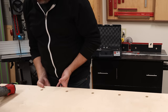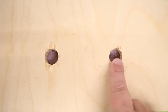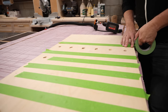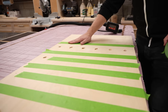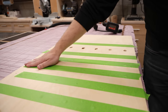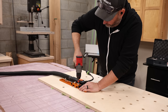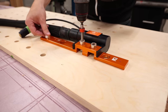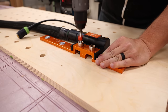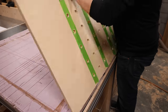After drilling a few of these holes, I did notice that there was more debris in the bottom of the hole than I expected, so I flipped it over to investigate. No bueno — blowout city. I really thought that drilling these out on the foam insulation was going to help prevent this problem, but apparently I was wrong. My last-second Hail Mary pass here is going to be to throw some frog tape on the remaining holes and then soldier on drilling out the rest to see if that helped. Once I had enough 20-millimeter holes drilled, I could switch over from the pins to using these locator dogs to secure the guide and drill out the remaining holes. This whole process took me about 40 minutes from start to finish, which surprised me, but the question is: did that tape work?